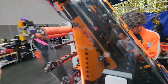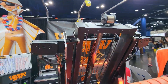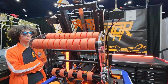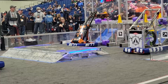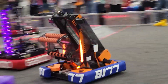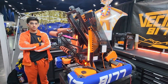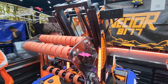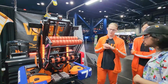We have about a 15-pound constant force spring pulling up our carriage because our intake alone is pretty heavy at about 15 pounds, so that was something we had to design for. The elevator is mounted at a 55-degree angle with large gussets at the top and bottom, which allows us to mount it super rigidly without a ton of bolts or pivot points. We also use tube plugs versus gussets — inspired by 3512's build blog — which saves time and gives more versatility with how far your bearing blocks can go.